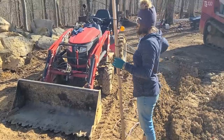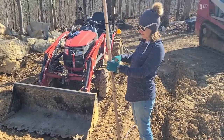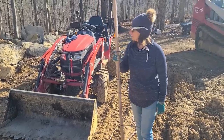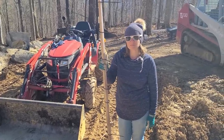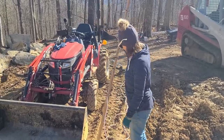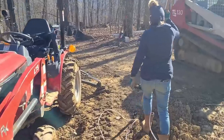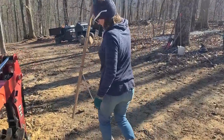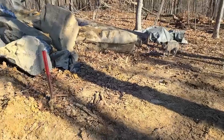I'm ready. Do we bring a pen? Yeah. Oh, you did? I did, yeah. Wow. All right, guys, so here's the deal. Meg, do you want to explain what's going on? We have a water level, right? Yeah. Okay, Meg is holding it. So we're going to get our zero point, which is right behind the tractor over there. And we're going to mark it on the stick. We've decided where, basically, the top of our footers is going to be. Right here. Yes. We're going to go at that stake.